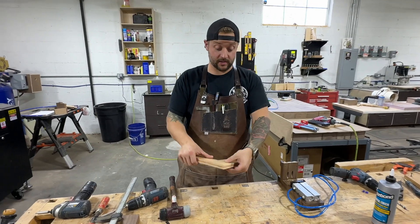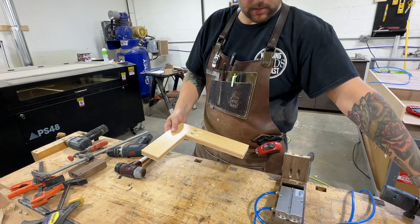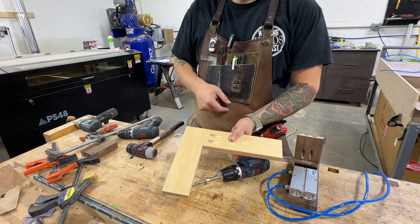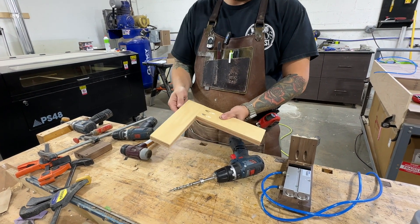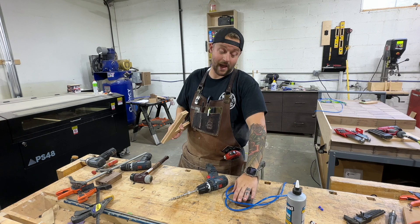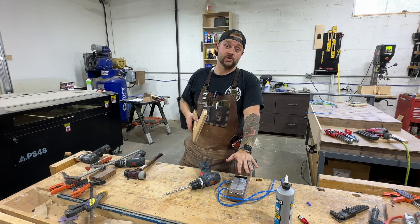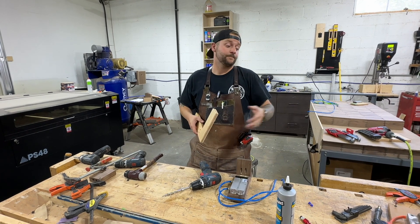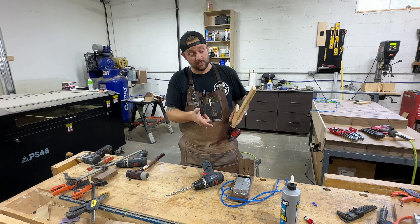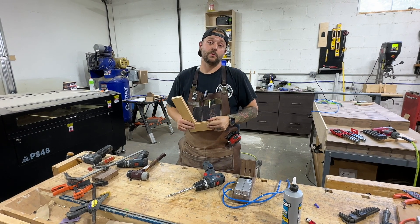There we go — not bad, that's actually nice and flush. We could adjust the stop collar on the drill bit just a hair deeper, as the washer head of the screw is sticking out slightly. It's a pretty easy way to make a pocket hole jig, and the pneumatically actuated foot pedal is probably the best upgrade you can have. Since Kreg doesn't make this jig anymore, the only way to do it is yourself. Let us know if you'd like a more in-depth video — maybe we'll do a version two with plans. Leave any questions or comments below, and we'll see you next week.